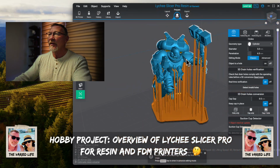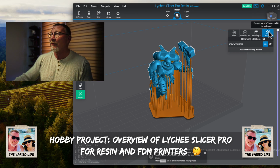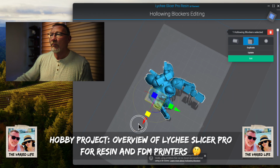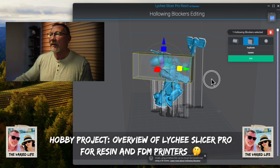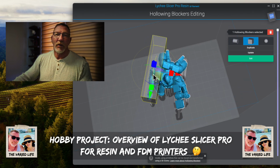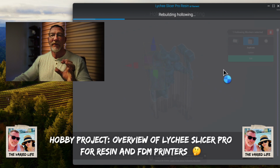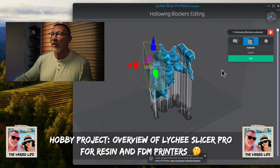So what we can end up doing is we could do some blockers. I should probably save this for another video, but on the top right, we'll click blocking, add or edit. You have some different options here. Let's just go ahead and do the square. And what we can do is manipulate this to where we can say we just want to get rid of the arm altogether. And we can move this so that the arm doesn't get any pockets of uncured resin in there, and you just update and boom. So whatever pockets were there have now been blocked off so that cavity will no longer be there. It's blocked out according to the software.